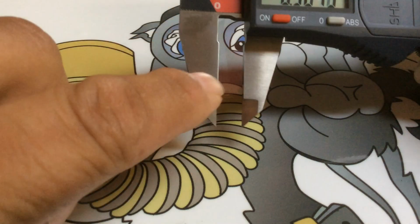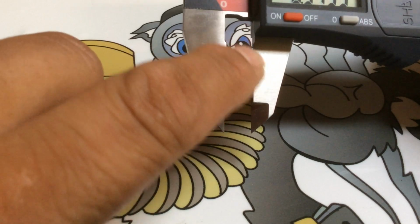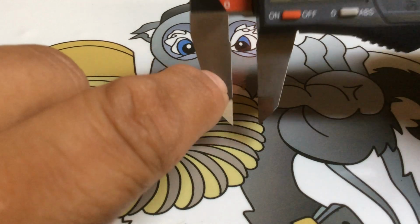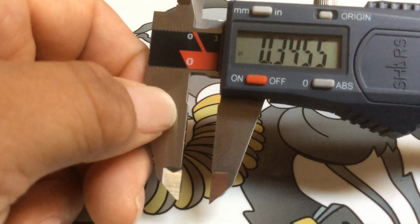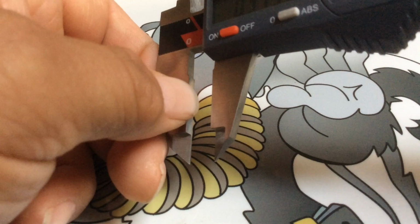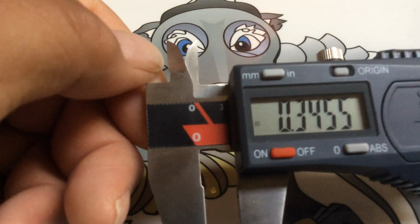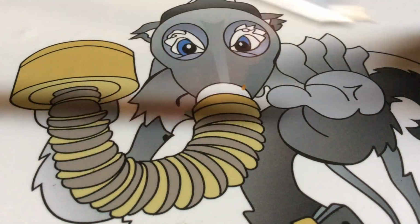Okay. Of course, they're brand new. Now you can see these. I tried to get them, but they don't sell them with carbide inserts. It's not an insert, well, it's brazed in there, but it's carbide. They don't sell them with carbide. If they did, I would buy it. Well, it adds more to the price that's already overpriced, but more expensive price. You can see these are just regular high-speed steel. And you can see the rabbit ears, same thing. They're just ground. And of course, on the depth, same thing.